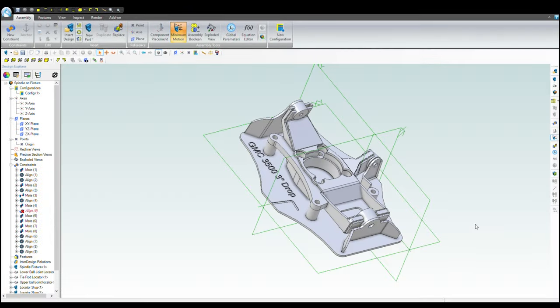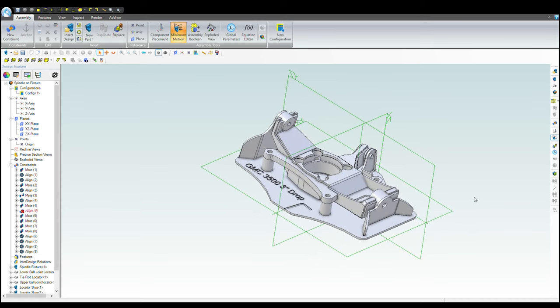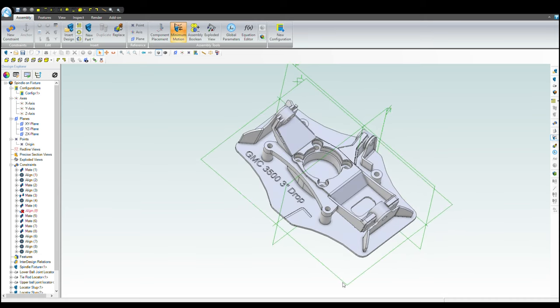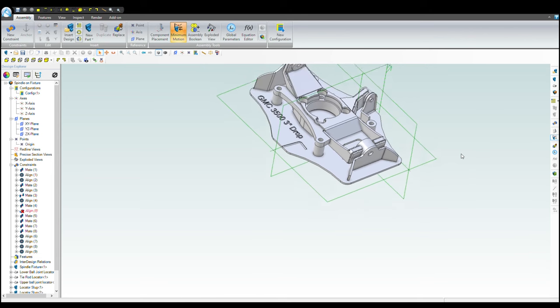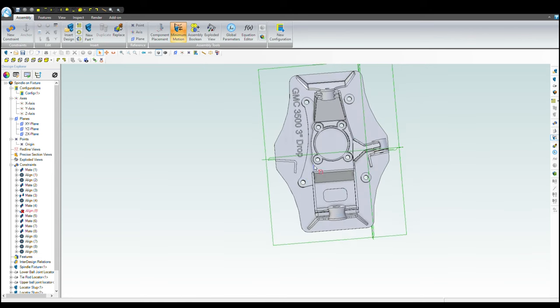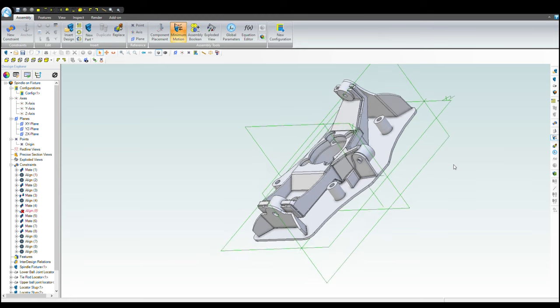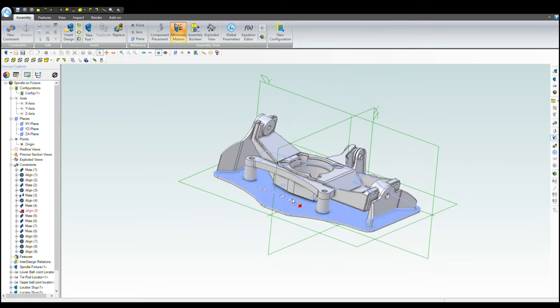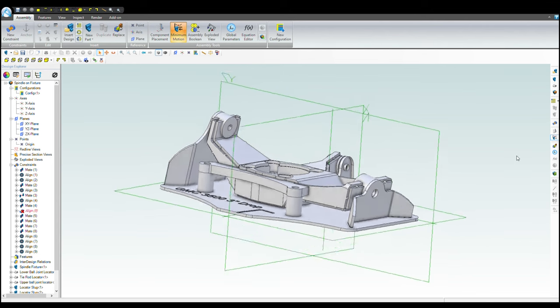One of the massive benefits with designing this in CAD is I can make my fixture directly in the program. So what I do is I take my spindle, start a new assembly, and then I make my fixture directly off of that. You can see I can set up all of my dimensions, I can set up my angles, I can build this fixture in CAD. So when I build this in real life on my fixture plate, then it holds these tolerances for whatever I need.